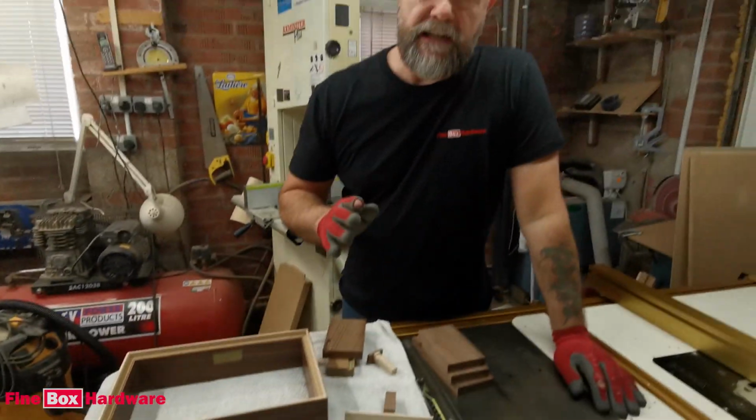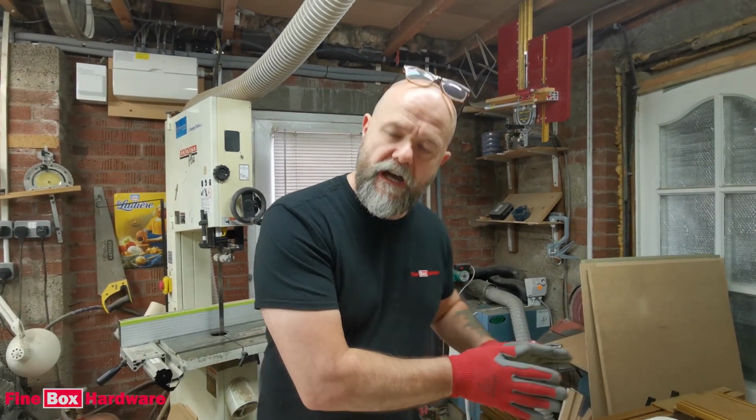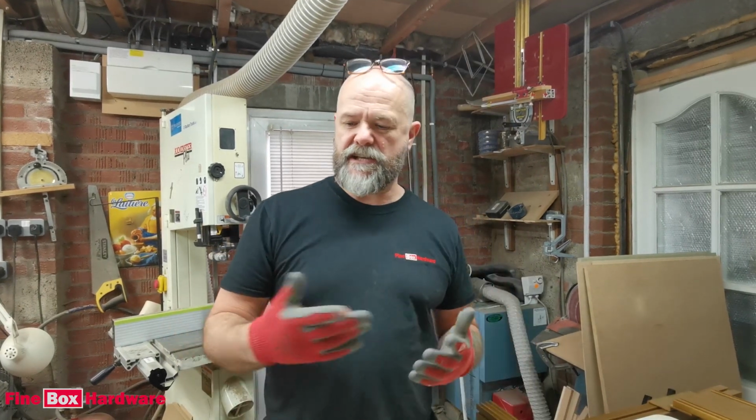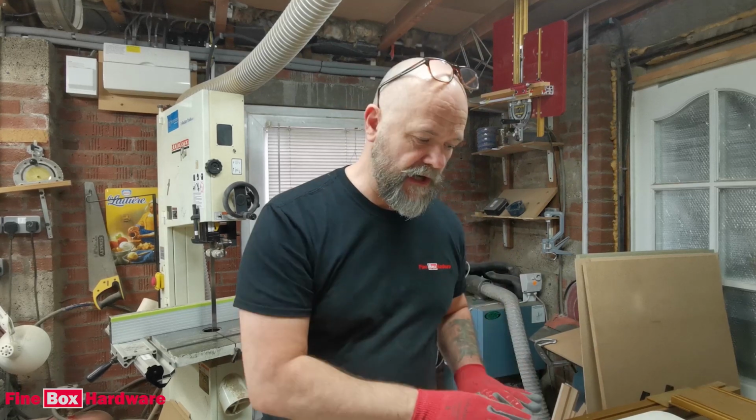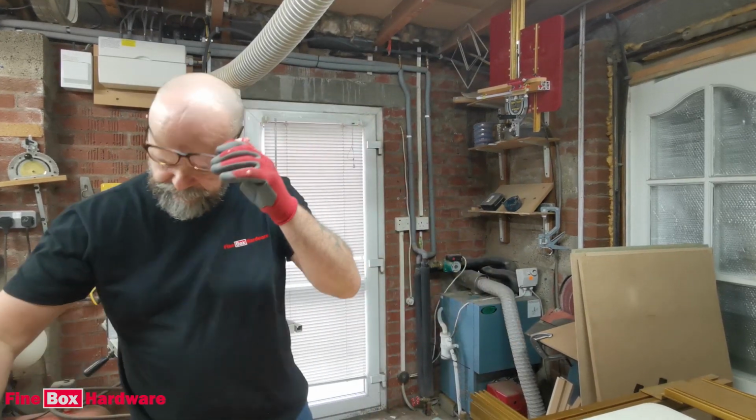Just to mention another thing, guys, you've seen me plunge it, go in, bring it back out and go in again. That's in case there's maybe been any chips in the way of the mortise there. It's always best to go in twice so that you're making sure you're getting that correct depth, okay?